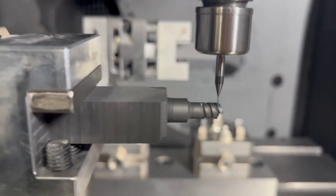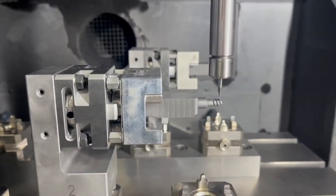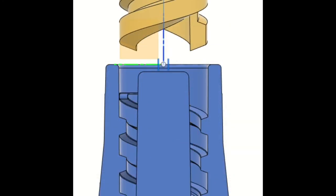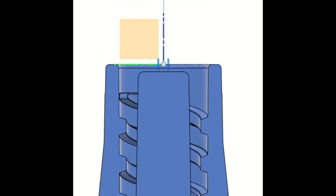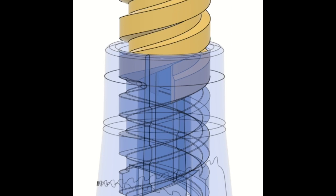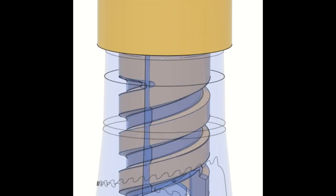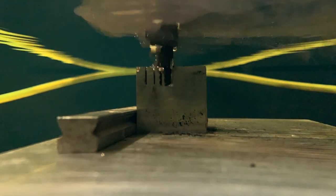This electrode is one that is absolutely necessary for a very specific burn application — there is no way we could do this process with a 5-axis. Some people do have 5-axis machines that cut electrodes, but we do not. We have 3-axis and an angled setup to cut it on four sides. As you can see, this electrode is doing a very unique burn, and as you can see underwater, this is not a simple electrode. It took a long time to set up and measure properly.